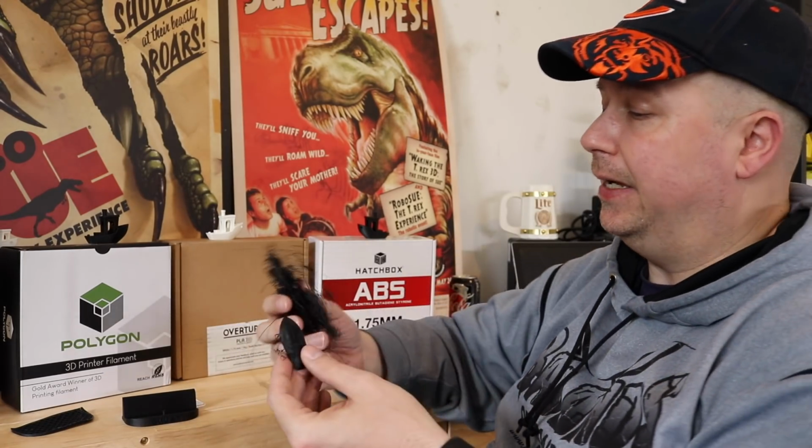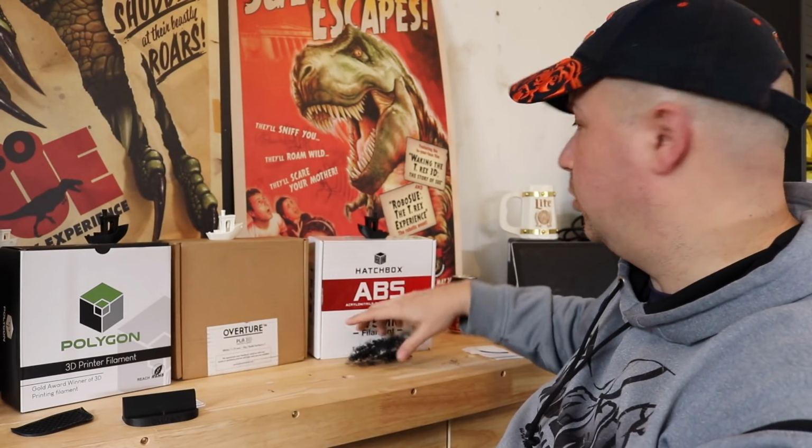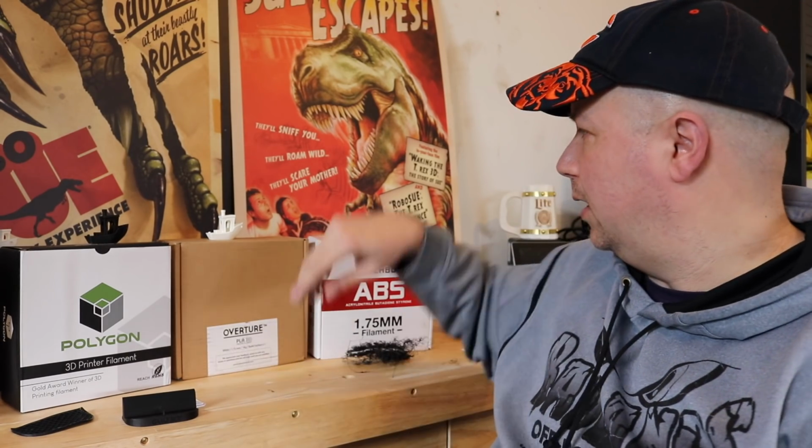So let's go back to the drawing board. Be a little patient. So I let the bed get up to temperature again, and I let the enclosure sit for about 35 to 40 minutes. The enclosure got up to 100 degrees Fahrenheit, and the base, with the assistance of that little heating plate, got up to 95. Awesome, right? Now I'm going to print this Benchy again. But also I'm going to reduce the speed down to 70.